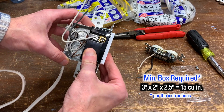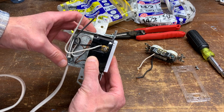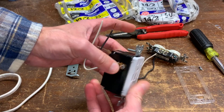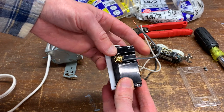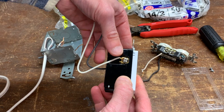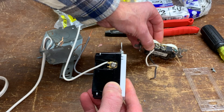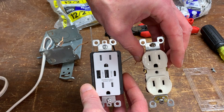Hopefully if you're installing these you're familiar with the box fill requirements of the NEC and know the handy formula for calculating box size based on the number of conductors. Secondly, while the manual says they can be either backwired or wired around the screw terminal, I struggled to get a 14-gauge wire around the terminal. I did it, but there wasn't much clearance to get my loop around, so it's easiest to backwire. And it's not the typical backwiring where you insert the wires into the holes in the back — you put the wire under a tab, which is challenging if you're wiring it into an adjacent receptacle.